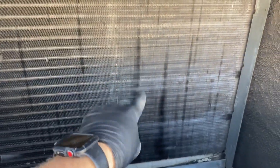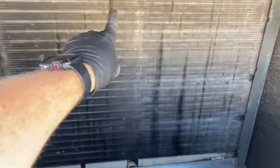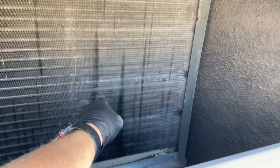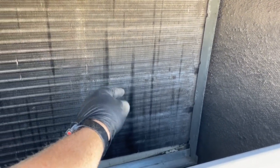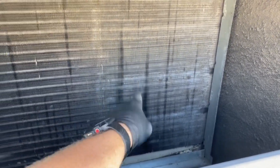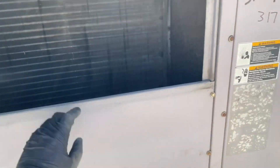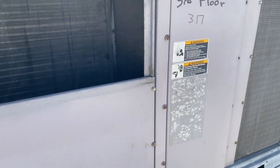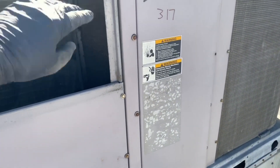You can see these lines here — most likely that's compressor oil. These are possibilities; they could possibly be leaks, they might not be, but we're going to check it just to cover our bases. I'm going to check all the obvious spots, make sure nothing's rubbing up against anything, and this unit's not vibrating too crazy. The coil isn't plugged or anything.